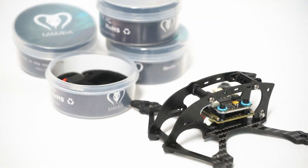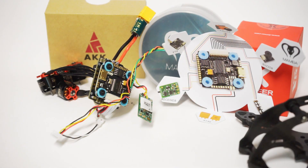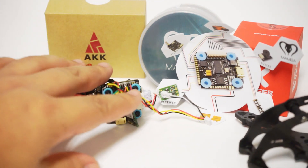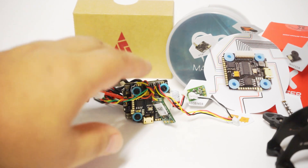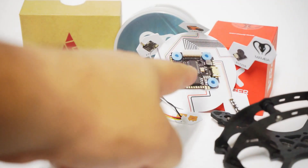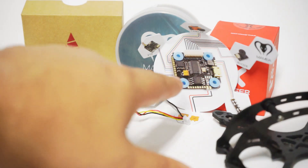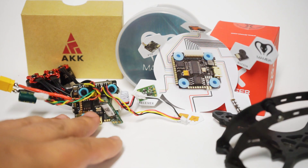Let's do a test fit in the drone — and it's going to fit perfectly. I have everything wired up and just before I put it in the frame I wanted to show everyone how tight this is. These pads are very very tiny and it is difficult to get everything soldered up the right way, but as long as you go slow and be careful you can get it all done. I'm going to throw this in the frame with my AKK FX3 VTX, micro monster camera. It comes with a nice paper diagram that shows you exactly where all the wiring is — I use this, it lines up, it sits up perfectly.